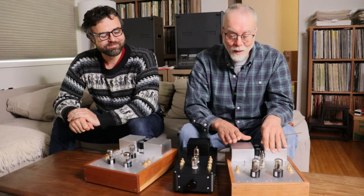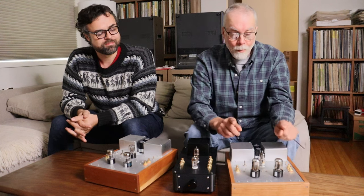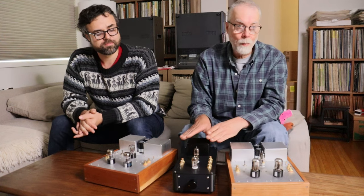At some later date maybe we'll think of something we can improve, but at the moment this is the best sounding phono preamp that I've ever heard. The interesting thing about what we've done here is that unlike the way we're supplying voltage for the filaments on the original, Charles came up with the idea to have our transformer manufacturer give us a custom 6.3 volt AC filament supply for this preamp. It just so happens that our core transformer will work beautifully in this design in what we're calling a quasi dual mono design, and in a future episode we'll look at the specifications, the schematic, and talk about that.